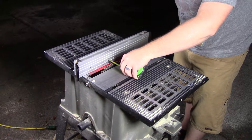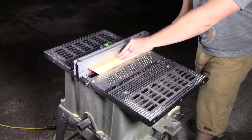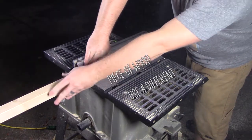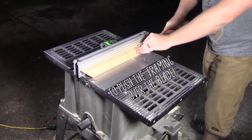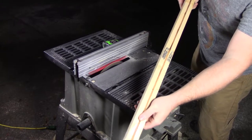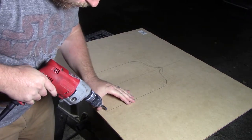You can use this method to make even wider notches simply by moving the guide out after each cut. Once you have it set, run all 4 of the pieces over the blade twice, flipping the piece around between each pass. Make sure that you are cutting on the correct side, as having the notch on the outside will mean you need to redo that piece. At this point it started to rain, so I took the camera inside before finishing up. I cut a pair of 12 inch feet to go on the bottom and rounded the edges with our palm sander. A short while later the rain stopped and I brought the camera back out.